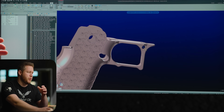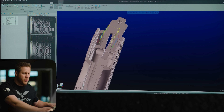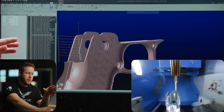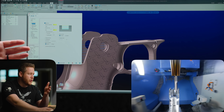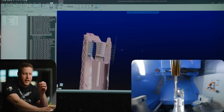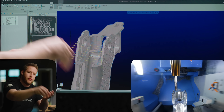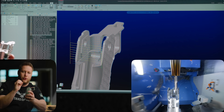After that, we can start our finishing process. I'm going to finish this inside pocket first — it does the floor and then comes up to do these walls above the two bosses. I'm getting very conservative with it, stepping down maybe a hundred thousandths at a time, because these walls are getting so thin that I really don't need it to chatter and I need to hold a very consistent size. The main thing that's important on this operation is the distance between these two pads, because that's where the frame is going to sit and locate on the grip. I need to make sure that distance is held to a very tight tolerance.